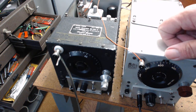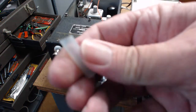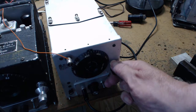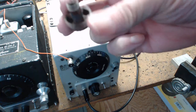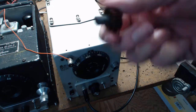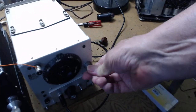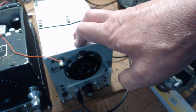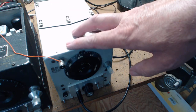It's a cute little hobby. I've shown you my power supply in depth and that'll clear one hurdle for you. Using ice maker tubing for the knob will solve your knob problem, because you might not get one of these old radio knobs. Someone figured out where to get them and was selling them at one time for $1.50 - good luck finding them now. You're going to have to take this tuning capacitor apart and oil it - use really fine penetrating oil, blow it out, brush it out, be very careful.